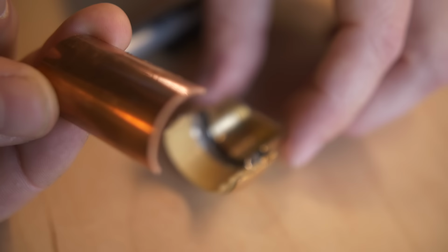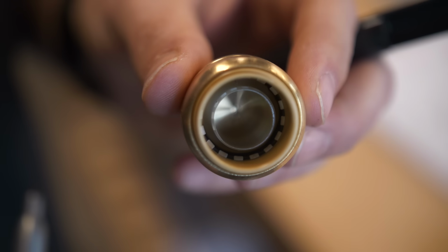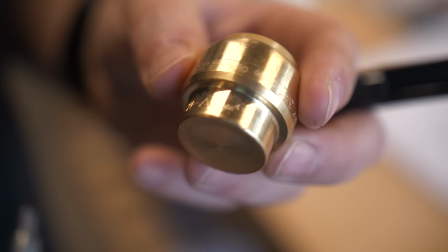Okay, so what are the takeaways? Where can you use these? Where don't you wanna use these? As I mentioned, no ground contact. I would be hesitant to put these in a wall personally. They've only been on the market 15 years, so I do worry about some breakdown. This is my personal opinion, but I would only use these in a place where you can see them in the future, meaning maybe a basement or a crawl space.